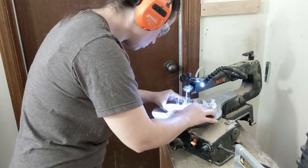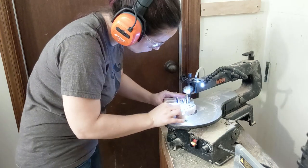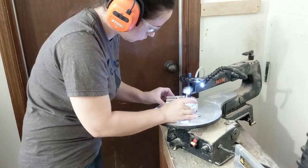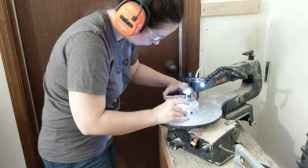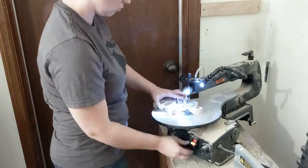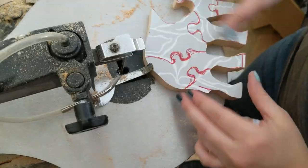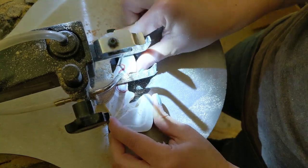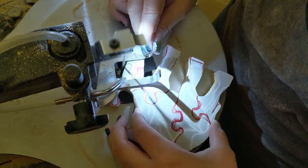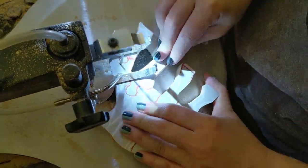Another tip: since you have the template available, you may want to cut through the puzzle pieces first before cutting the outline. I obviously didn't do that because I hadn't drawn the pieces yet. But this will give you a bigger piece to hold on to. A scroll saw works best when you can keep the piece flat, and smaller pieces make holding it steady that much harder — and that can lead to a snapped piece if you're pushing against a thinner spot like the trunk.